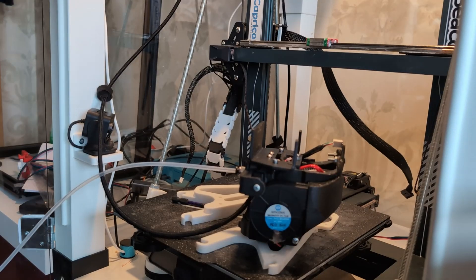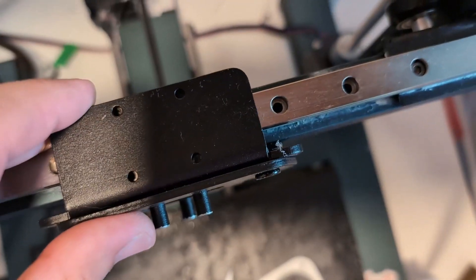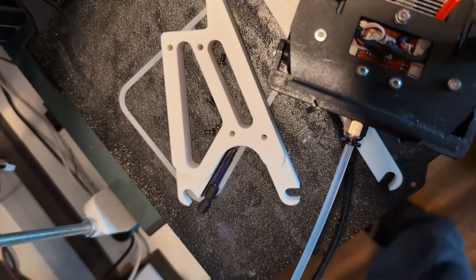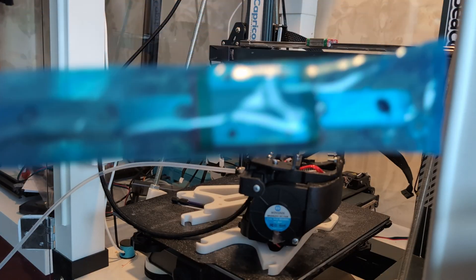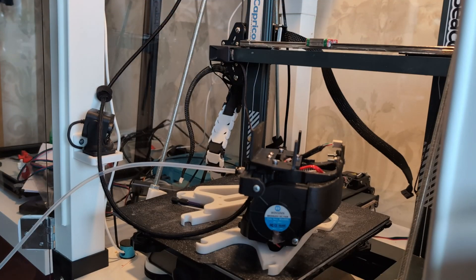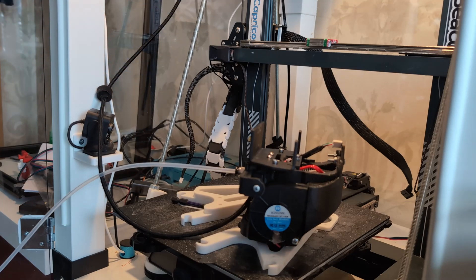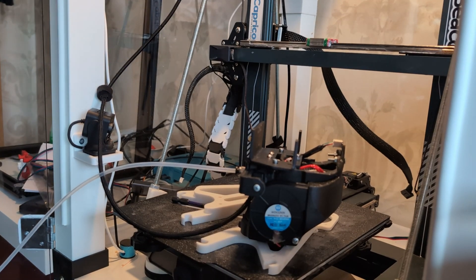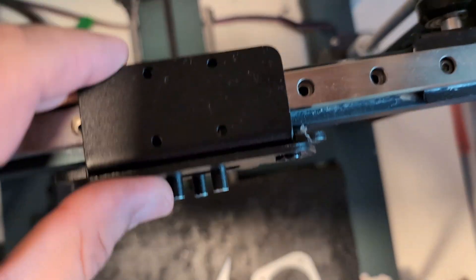I wanted to double check that the blocks I got for the linear rail were correct and lined up with what I already had and the metal bracket for the second toolhead. That's when I started to realize they don't match. I bought a linear rail with MGN12H blocks — actually MGN12. Turns out one toolhead is designed for the H pattern blocks and one toolhead is designed for the C pattern blocks.